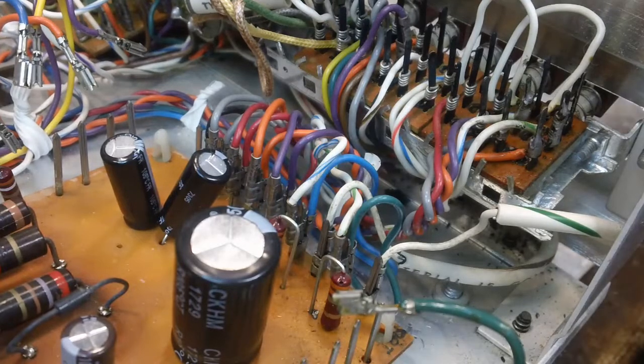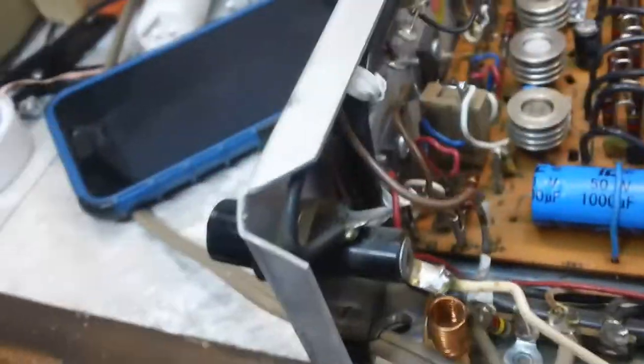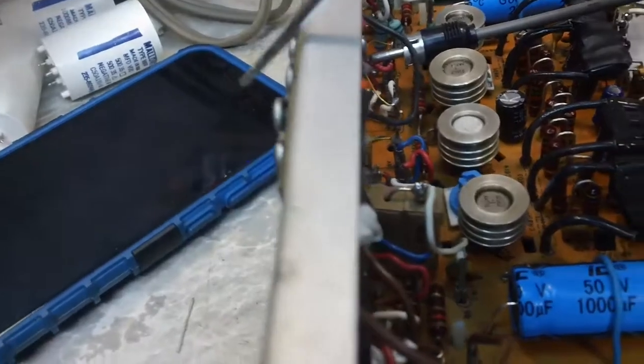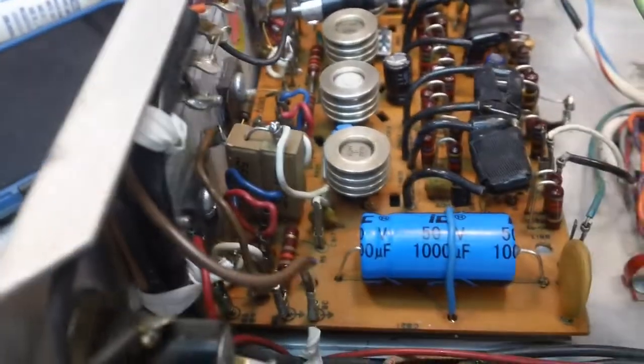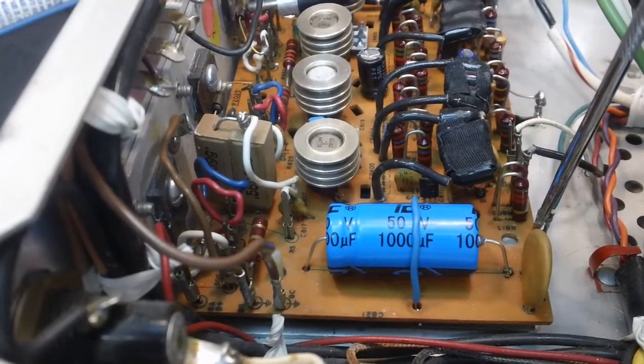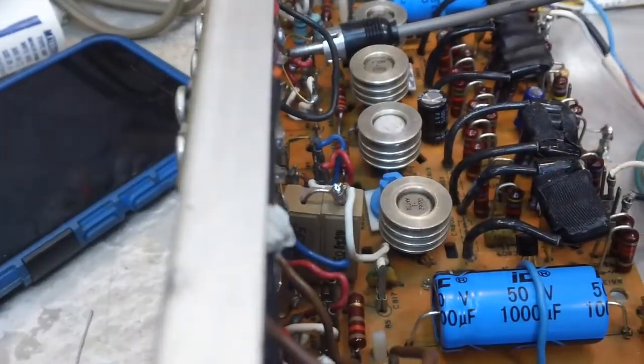If you run back to the back, there's an orange wire on the output, a speaker terminal there. I have double checked these. They come down to 0.2 ohms between the output here and the output on this, where you connect to the speaker back here. When I switch the remote or the main switch from here to main to on, there's 0.2 from here back to here on both panels. So I'd say I've got that pretty clean. At least I'm going to go with that.